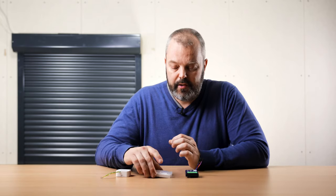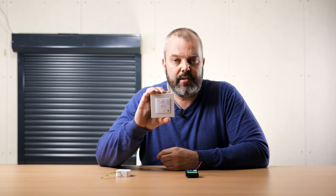But it's not limited to use in combination with the switch. You can place the receiver anywhere you want — between mains power and your awning or shutter motor. Plus, you can even take the switch away, so you can install the receiver module at the place where your switch was and not connect the switch at all. You can, because then you have an extra control point, but you don't have to. Once you install the receiver module, you don't need to use your regular switch anymore. You can use a wireless switch such as this one, which is a Somfy Origineo I.O., and that can be placed anywhere you want, so you're not restricted to where the cables are. You can place it anywhere in the room where it's convenient.